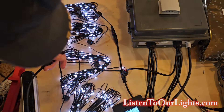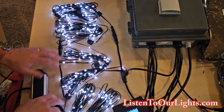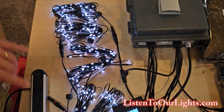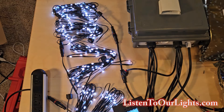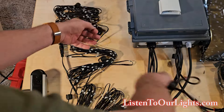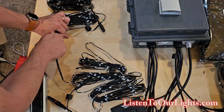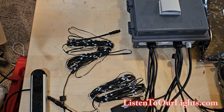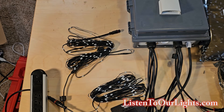The cable is heavier than the lights. The lights are light, which is actually really good — more versatile. My purpose of this experiment is I want to understand the properties and characteristics of these lights. I know I can go about 200 pixels reliably before I have a problem. So I'm going to reconfigure this, disconnect the power injection, and now disconnect 200 of these because 200 is what I know to be reliable.